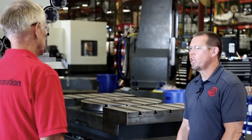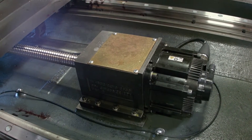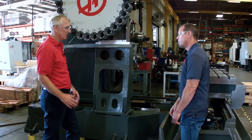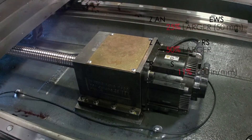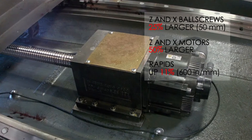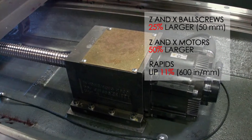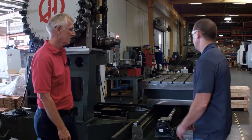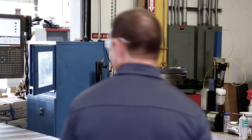Standing here talking about the tool changer, I keep getting distracted by this. You guys changed the ball screw diameter and the motors, didn't you? By reshaping the base, we could put a much bigger and faster ball screw in, and that requires a bigger motor to make the machine faster. But it's not just because of that motor — we actually redesigned the column completely. We got a lot of mass out of the column, which allows us to move faster under more control.